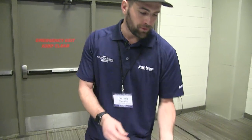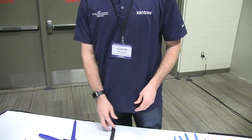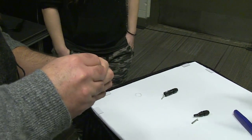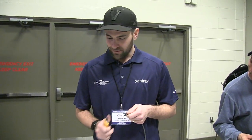Yeah, I passed the MC4 cable round before, and plugs, you can have a look at them now, showing how they connect and disconnect. It's very simple. I'll strip the cable back and crimp the connections on. So best to use a sharp knife, and obviously when you're using a sharp knife, be careful that you keep your fingers clear of it.